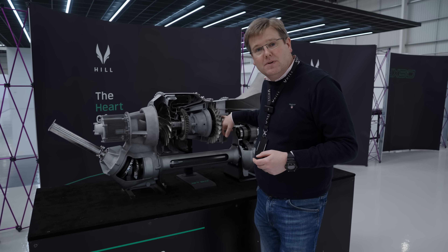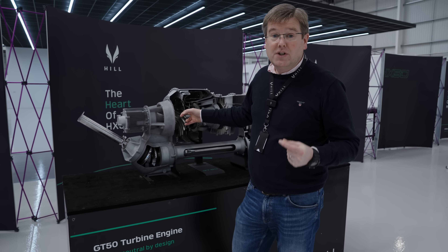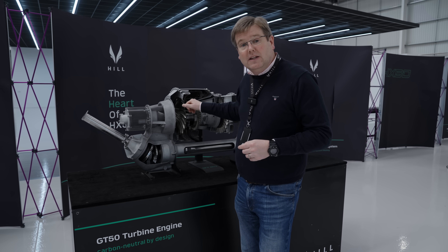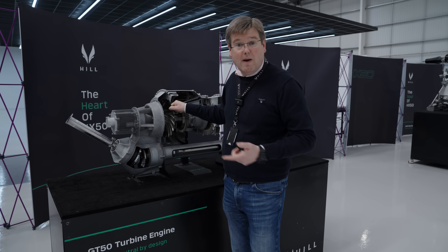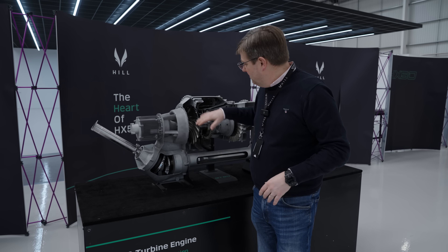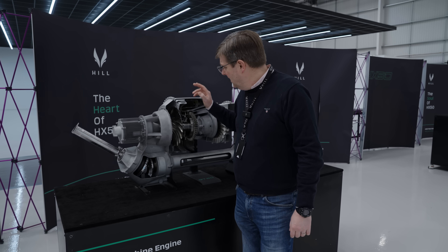These are the flows that pack the bearing chambers to keep the oil where it's supposed to be and provide cooling to the turbine discs and all the highly stressed components in the centre of the engine. The new compressor is actually two percent more efficient than the old one. We've also developed ways of optimising the level of polishing in the gas-washed surfaces within the compressor, so we can squeeze the efficiency up if we need to on test. We've now also completed the study on critical tip clearances between the compressor blade tip and the shroud, and implemented an abradeable coating to protect against titanium fires and allow us to bring the compressor as close to the stationary components as possible. That compressor is now ready to be built for test.